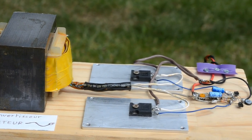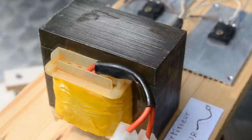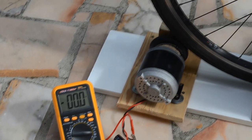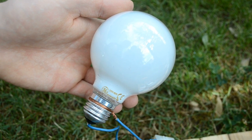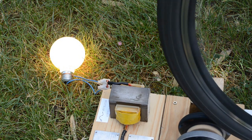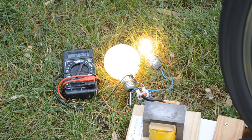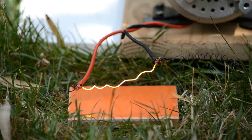To try some other devices, we made a simple inverter to convert the DC voltage from the generator to an AC mains voltage. Its maximum power is around 100 watts, so clearly less than what we are able to produce. A first test was a 50-watt light bulb. We add a 40-watt bulb, and it's still possible to exceed 230 volts, their rated voltage. We will perform other tests at full power at the end of the video.